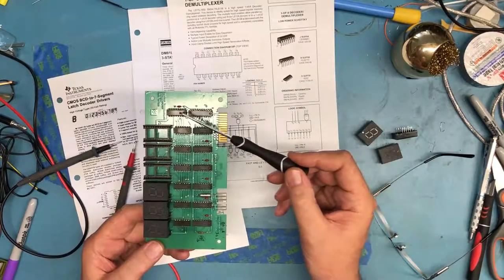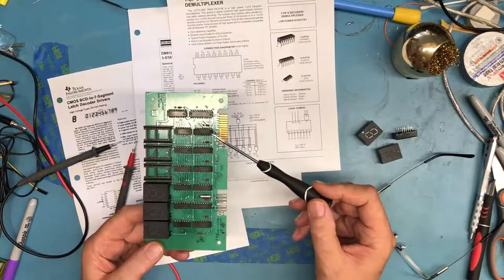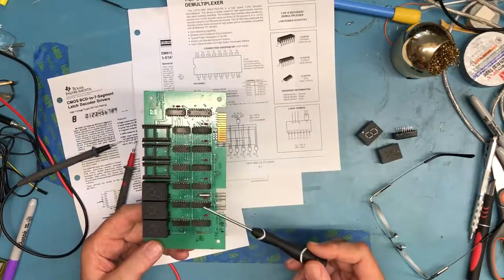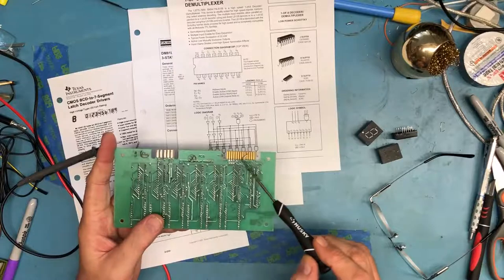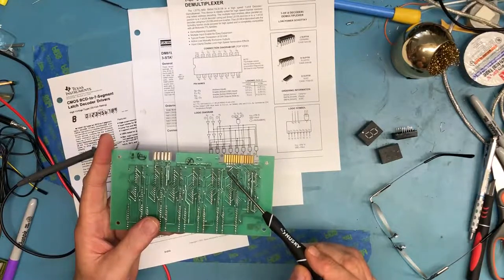And then I can send a latch signal that's gated somehow, probably through the LS138, and pulses the latch pin on whichever device is selected and latches its BCD value. So it gives you a pretty simple interface here overall. Again, board position select, I assume.